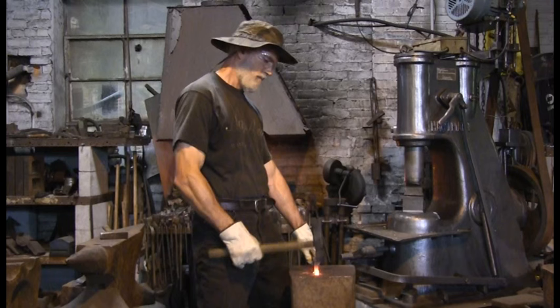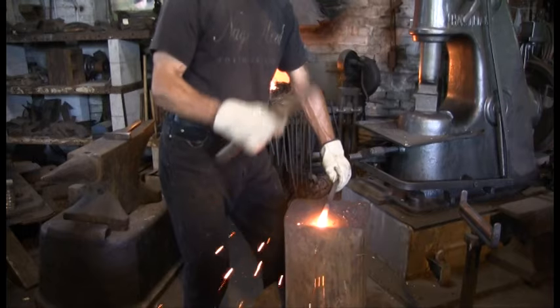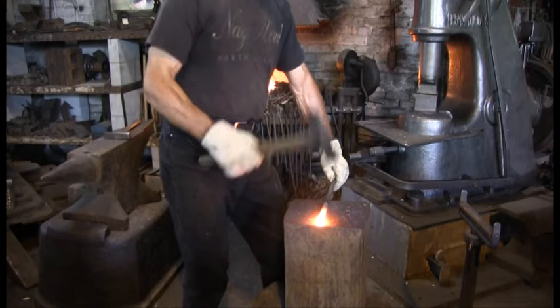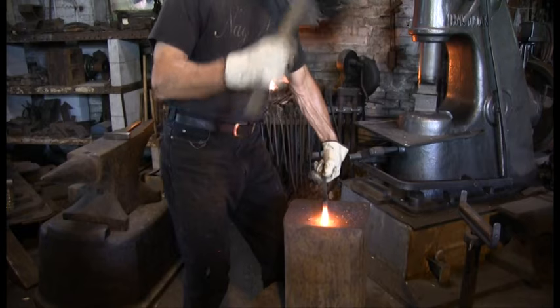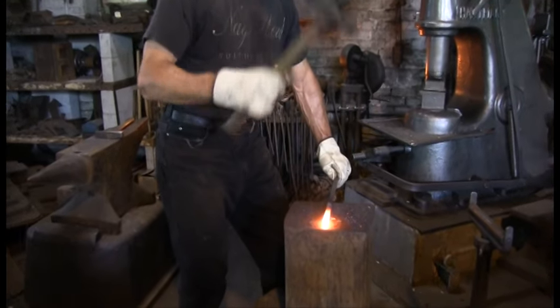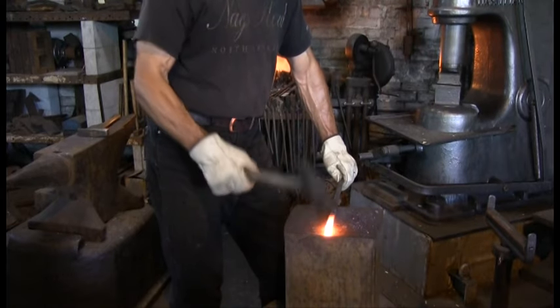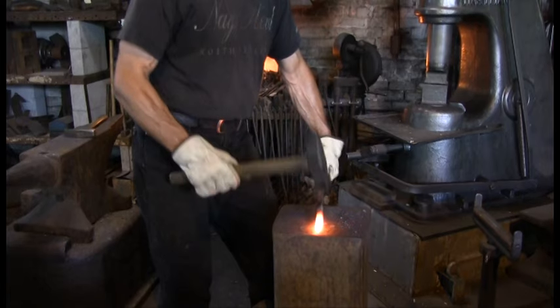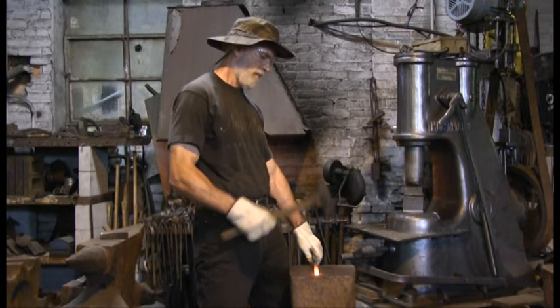Here I am delivering a blow and I'm completely relaxed. If you look closely at my hand, you'll see that I'm actually only gripping the hammer with my thumb and the finger next to my thumb — the rest of the fingers are kind of loose on the hammer. This is the key to the whole deal. I swing the hammer like a drummer swings a drumstick. The hammer bounces freely off the work and I don't get any shock from the blow. The hammer comes up and flops back in my hand so there's relatively little motion of the hand but a lot of motion from the hammer. The more motion from the hammer, the more velocity and the more work you get done.